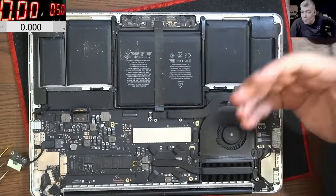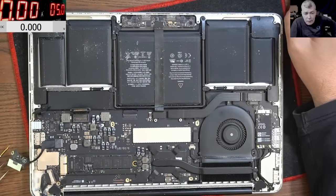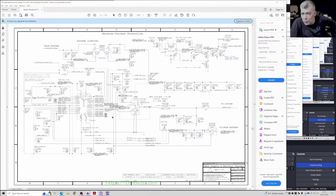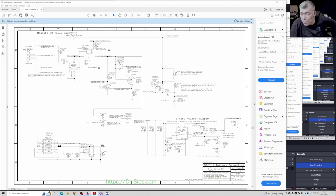The point of this video is that MacBooks look complicated, but actually most of the faults I find are around a few things. Our problem was the input fuse was burned and this chip was shorted. This is a power management chip which creates the main power rail of the system and also handles the input MOSFETs. This chip was shorted. The other common issue is the 3.4 volt power supply — and I've found those diodes burned so many times.